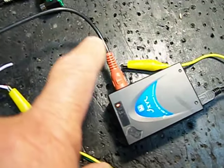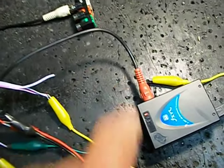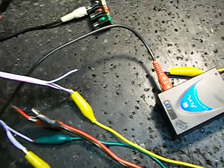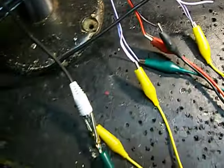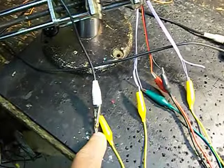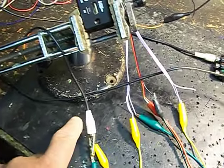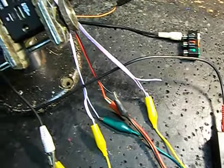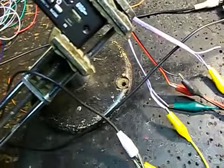That's Bluetooth — it's playing a signal here back to the little AM radio that I have here. Coming out of the module, we're going to a little power amp through this RCA jack here. Here's the power leads, 12 volts in. It's really very simple.